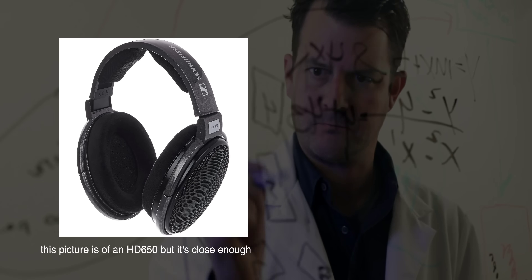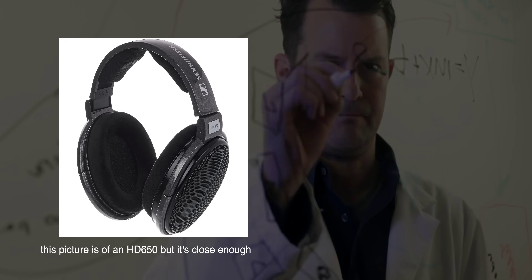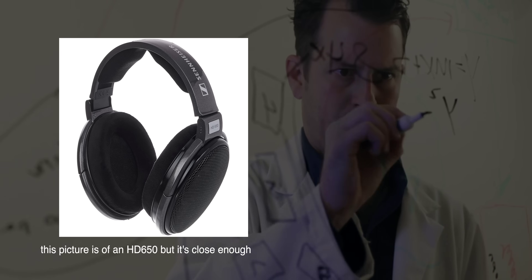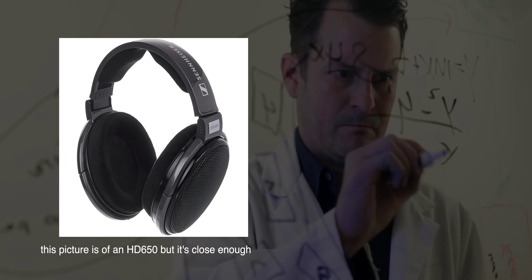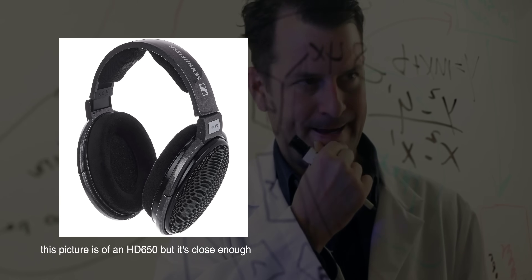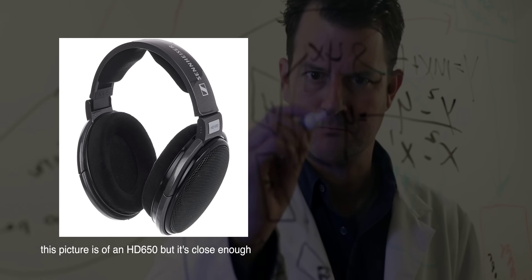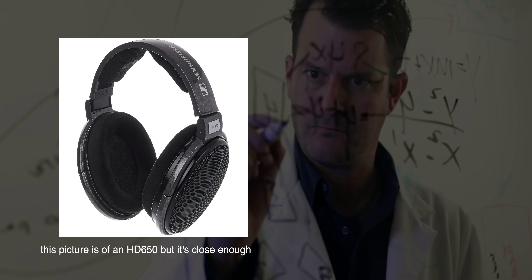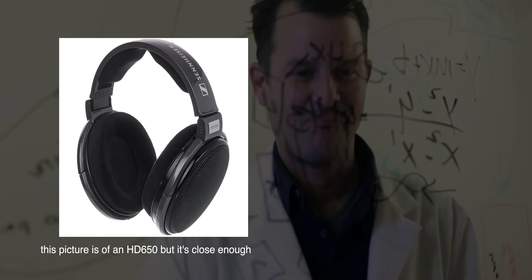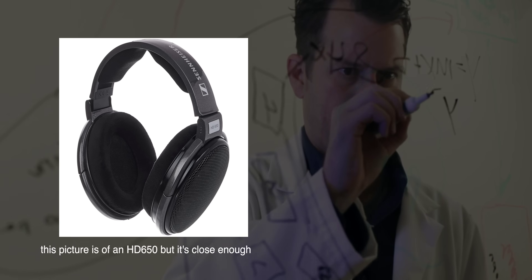The low impedance parts of a headphone's frequency response — the ones which take more current for the same voltage because impedance is voltage over current — will get quieter relative to the high impedance parts. Let's take the HD6XX as an example. Driven from an amplifier with no output impedance, we get a little more output at 100 Hz than we do at 500 Hz. That's because 100 Hz is around the natural resonant frequency of the driver, where it stores energy the most efficiently. We also see the impedance rise at 100 Hz from 330 ohms to a little over 500 ohms, but at 500 Hz it remains the same. If our amplifier supplied 1 volt into 500 Hz, we'd get about 3 milliamps of current, but at 100 Hz it would be a little under 2 milliamps. In spite of that, we still get a little more output at 100 Hz than 500 Hz, because that's where the driver is more efficient.